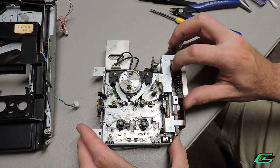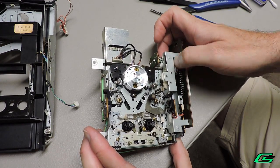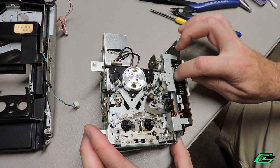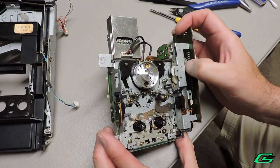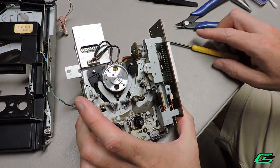We can see the motor, belt, and gears of interest here. I can turn the motor by hand and see the take-up rollers move, but they are binding up quite a bit. It's slow to see, so I'll speed up the video. I've cleaned the old lithium grease that was gummed up. Now the take-up rollers work much smoother.